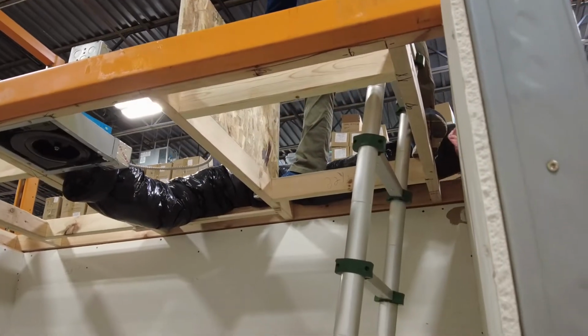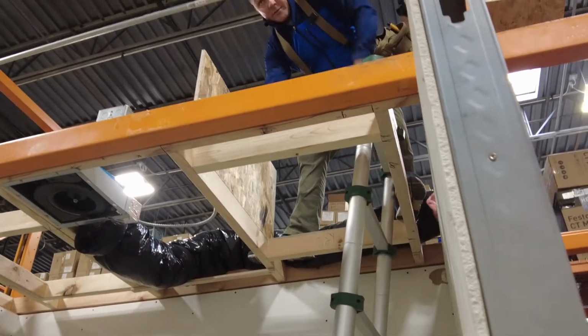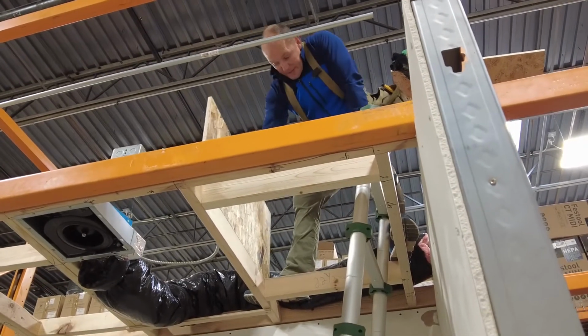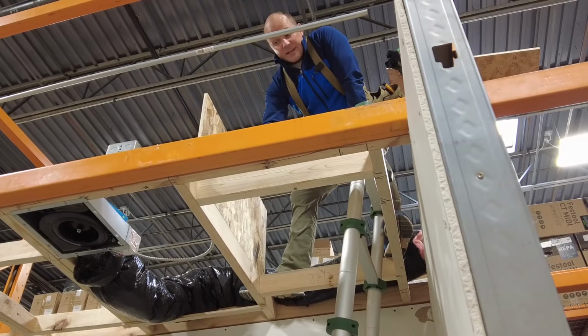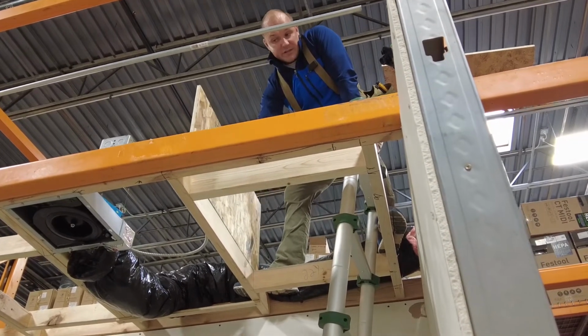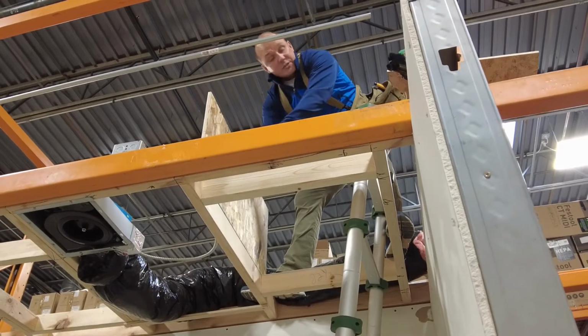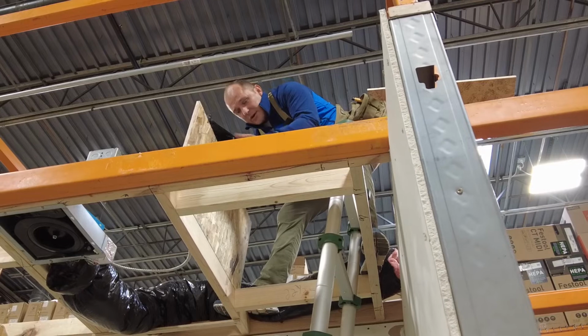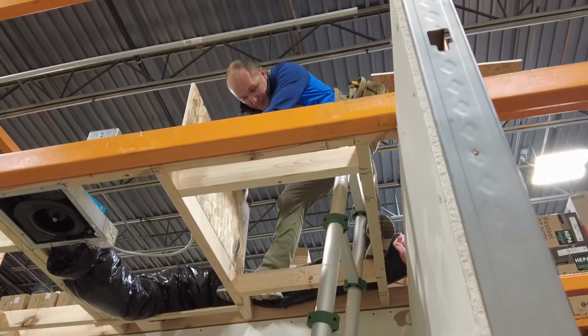So how many inches do I have to be past this either way? Well, at least 1.5 inches, right? Because I have a 1.5 inch nailer. I made it a little bigger, right? But that's all it has to be, okay? So don't get too fretted over this. If it helps in the beginning to mark back 2 inches, 3 inches, you can do that, but don't get too crazy about it. As I said earlier, I could be up here a long time.